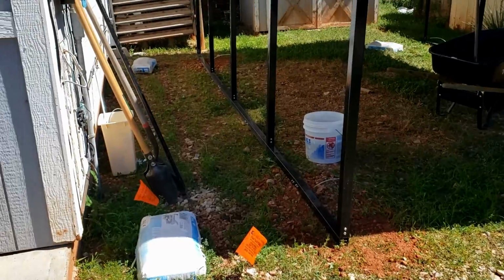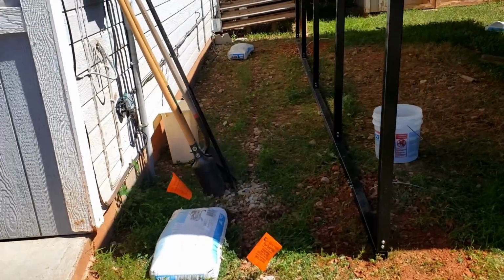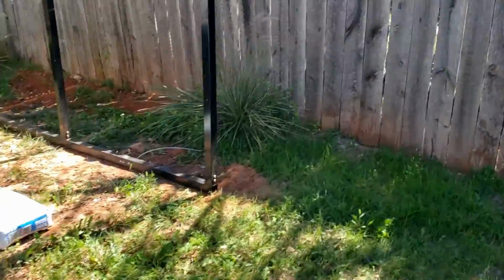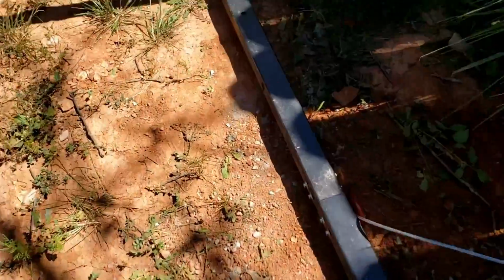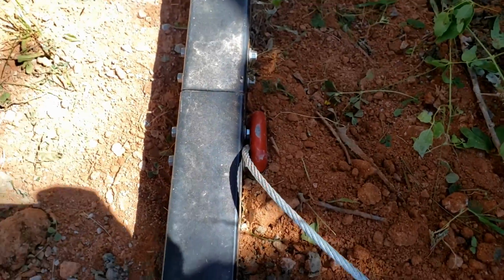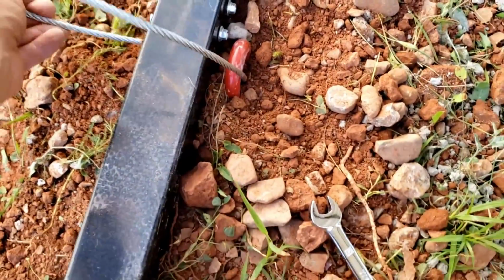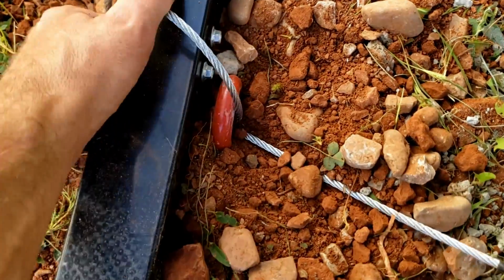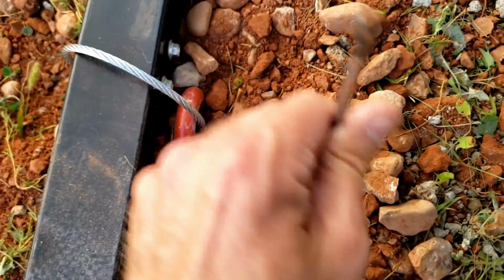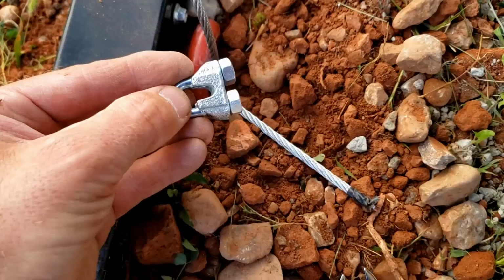Alright, as you just saw, I walked the carport over to its final position. There's enough room to walk between the house and the carport over here, between the fence and the carport over here, and we landed at all 4 points right next to our anchor. All that is left to do is to loop this cable under here through the eye of the red mobile home anchor. So I have a loop, and then secure the two cables together right here with this fastener.